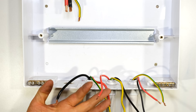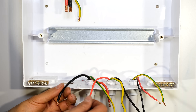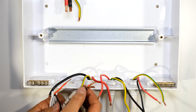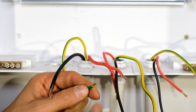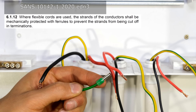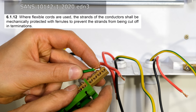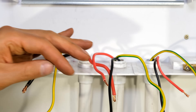In this lab we use flexible stranded wire because we reuse the wires for each demonstration. In your case you will probably be using solid core cable. If you are using stranded wire it's very important to twist the strands. You can also use a bootlace-type ferrule and crimp it to make sure the strands do not open when fastening into a terminal. For the remainder of this demonstration I will be using these flexible wires.